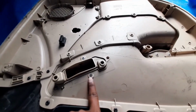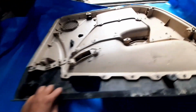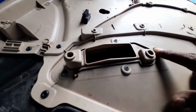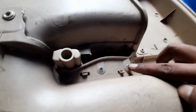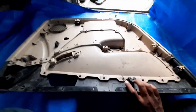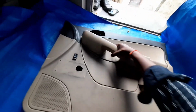Now if a screw boss is given here, and here also a screw boss is given, you have to make that space free so you are able to operate the tool, whatever screwdriver you have to operate. So you have to make free space for accessibility, for assembly and disassembly. So here also, see, screws are given, so such an assembly will be there. You have to decide depending upon the function of the part, the requirements of the project and the cost of the project, then you will get a surface like this after full assembly.